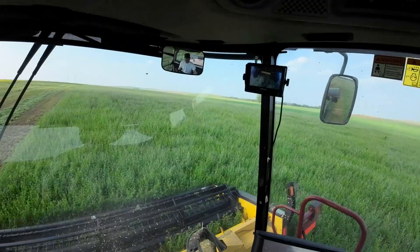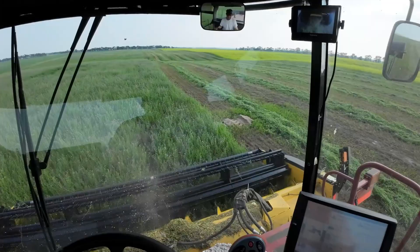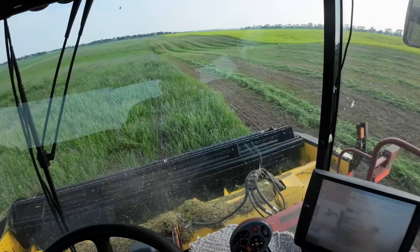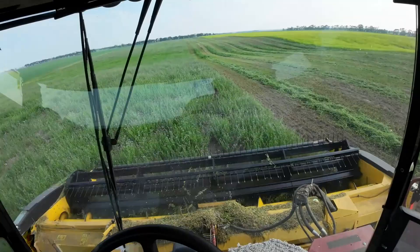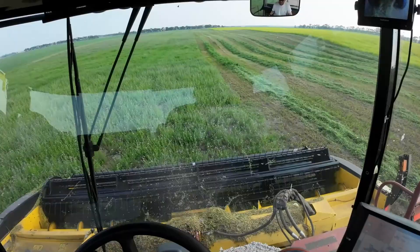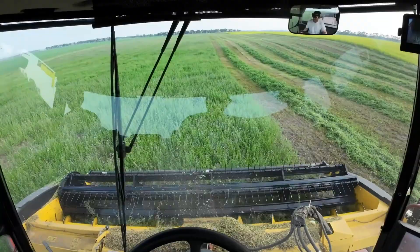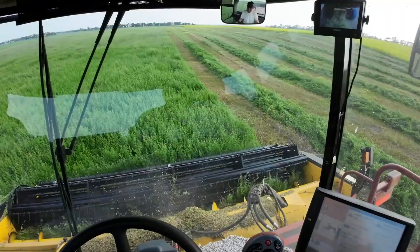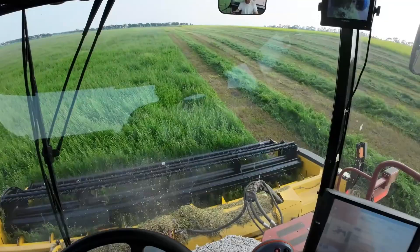I'm curious to see what it looks like when I come back around here. I think a badger made his way through the field — there's been a couple mounds like that going in line down this way. There's another mound — that looks like a gopher mound. At least avoid him. Can't miss them all; there's so many I can hit. The ones I can see that are blatantly bad, I just lift up. I know I could use the main cylinders for lifting, but it's a little more rough. The cut height cylinders are a lot gentler on everything — it's just the way they're plumbed.